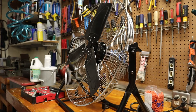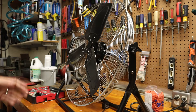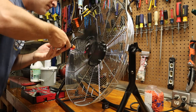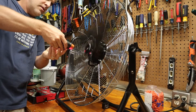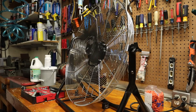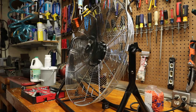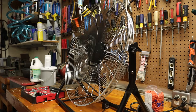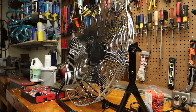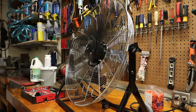A little more experimentation off camera. In the last shot I had a 10 microfarad capacitor hooked up, and I found that the 8 actually seems to work the best. With the 8 hooked up, we're spinning roughly close to 900 RPMs. About 900 RPMs, maybe a little less. You can probably hear it's not quite that loud. So we're in the low 60s — actually mid 50s. I had some friends over before and we were able to carry on a conversation. The motor starts reliably, so I think we're going to stick with the 8. Let's put it back together.